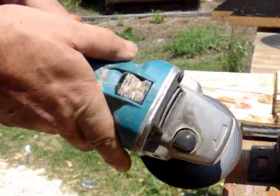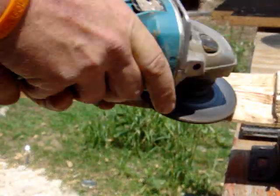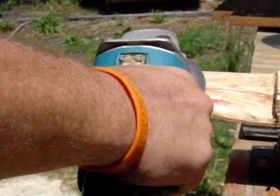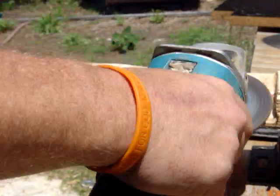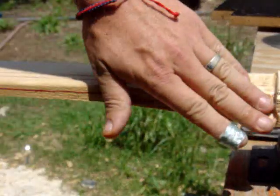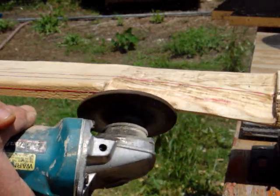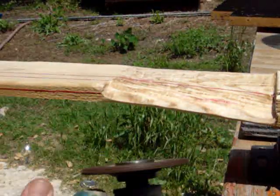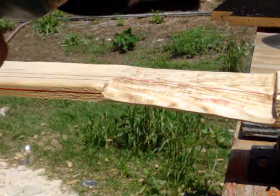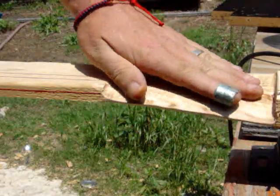I'm going to just curve it away. About a 45-degree angle here — it comes slow. And flatten it off. Each time you do a step of what I showed you, you need to do it on each blade and then balance it for each step. That way you know everything is going great.